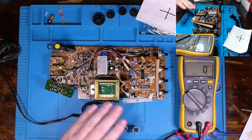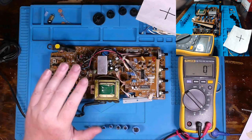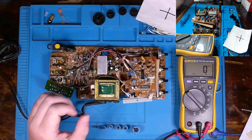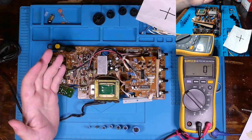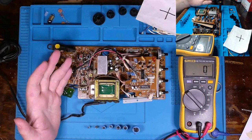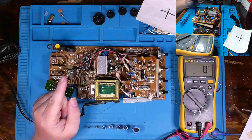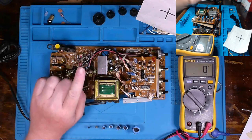Now, before I show you these capacitors with my multimeter, if you haven't annotated by this portion of the video, there's a general outline I follow when I'm troubleshooting things like this. If I don't have schematics or can't find schematics for it, it's basically a general rule I have for all electronics. The first thing I accomplish is a visual inspection. You cannot supplant a good visual inspection, okay? That is first and foremost.